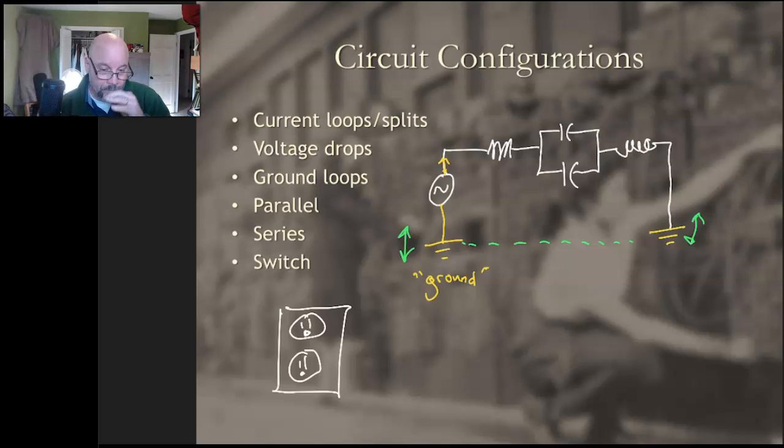Okay? And so the way this works is the smaller slit, and I'm not sure if it's on the left or right. That's what I was trying to look and see. I apologize. You can look. Whichever one is thinner, okay, that is connected to the top of an alternating voltage supply. Okay. This guy over here on this side is just connected to ground. Okay. That's connected to ground.